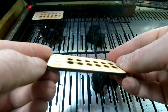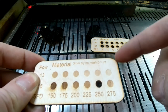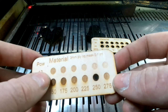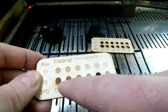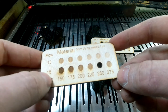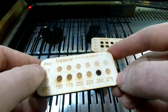This is the economy stuff so there's probably more voids in this than the others. With the engraving, I made a little bit of a mistake — as I was scrolling through the settings in Lightburn I must have hovered over the dropdown box and changed it to an offset fill instead of a standard fill. At higher speed and higher power you're probably going to need to start masking off because you get a bit of back burn, but that can probably be sanded or cleaned off. The writing was engraved at 125mm per second at 13% power, and I do like the 150 setting — it comes out quite well. I need to use very little power to get a decent engraving.